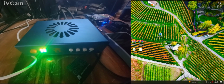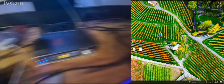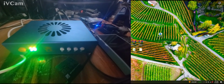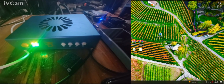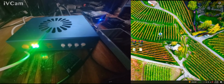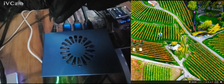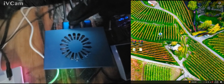But just know for most fusers it should be plug and play. I will be showing you the V6 and the D60 as those are the fusers that I currently have. If you have another fuser, such as Captain, the setup process might not be the same. So to start, I will show you all of the ports and buttons on the V6 fuser. Starting at the back, the very most left port is the power. Next to that is a USB-C port meant for flashing EDID. Most of the time you will not need to use this.